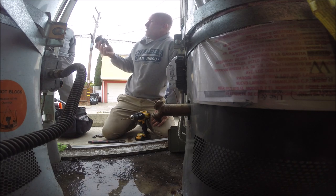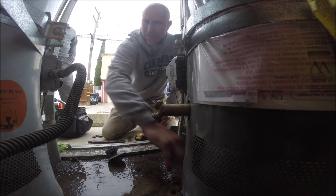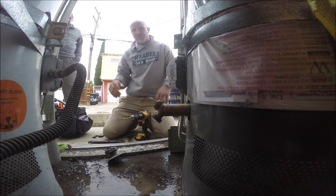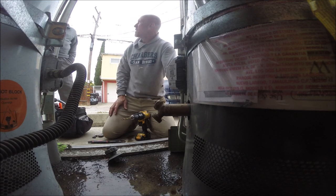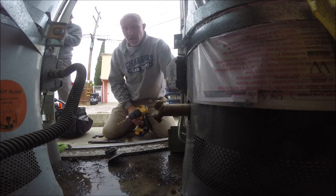Yeah. So I changed your drain valve. Whatever you changed. Because it was leaking, and you have water. Yeah. So yeah. I'm gonna drill a little hole down here. It's drain. Just to drain the water out. I appreciate it. And then I didn't see any spark at all, but I think the clicker's probably bad. It doesn't matter. We'll get that all fixed.